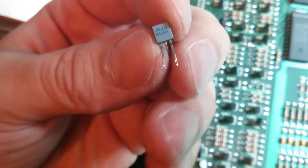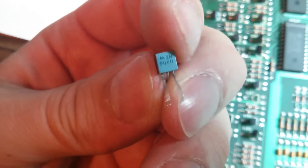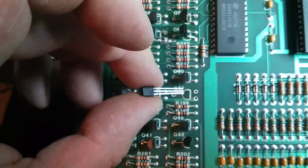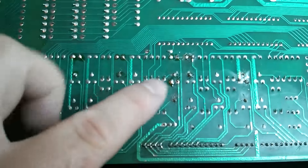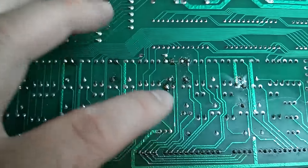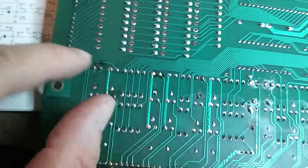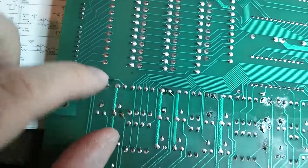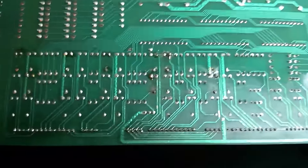So this transistor measured bad — I tested it with a diode test and it was reading open circuit on all junctions. That's a 2N5060, so we've desoldered it from there and we're going to bend the leads out on the new one and fit it in. Now some of these other transistors have already been replaced, as we can see from the flux marks, and the leads are quite long so I've trimmed them down. I'm going to clean all this up now and get the flux removed on this whole area, because this stuff can eventually go corrosive or conductive if it's left — it's like no-clean solder with a brown sludginess — so I'm going to get all that cleaned up and that should all be good.